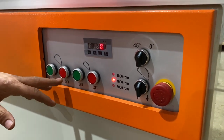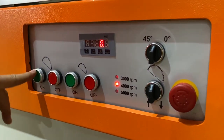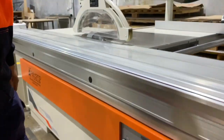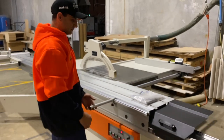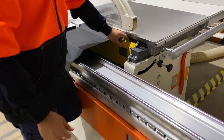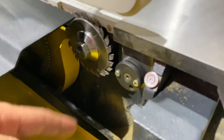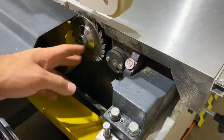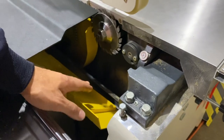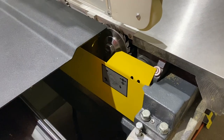If you do ever find that the machine is not turning on, it could be a few things. Your emergency stop may be pushed in or your blade guard may also be open. There's a magnetic blade guard here, so that's just held on by a magnet. When this is open the machine is isolated so it won't turn on. Just be careful that you haven't forgotten to put this back up when you change your blades or do a clean or anything like that — just put it back up and that'll close it off.